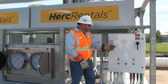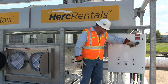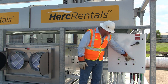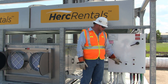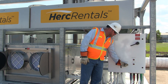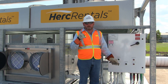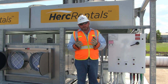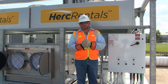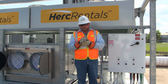Startup is fairly simple. We go to the main power disconnect and turn the power on. Our main power light illuminates and the phase incorrect light is off — we're good to go. The next step is the main system switch. We turn this on and it will immediately turn the fan on. Our blower is now running. Remember, on all rental equipment the indoor blower runs continuously because our return air sensor is inside the intake — we're constantly turning air over to the controller.